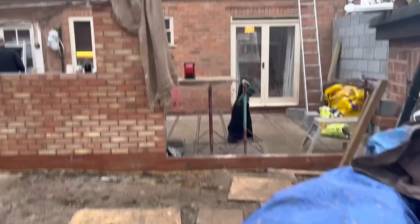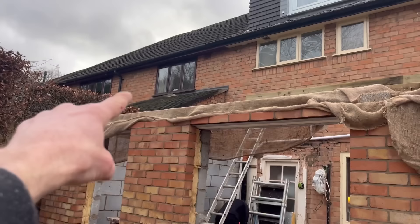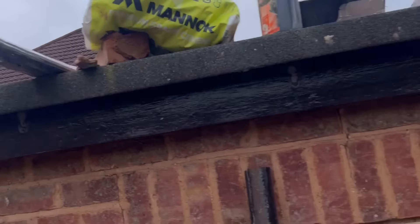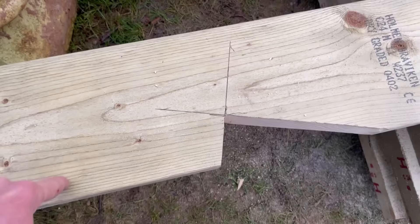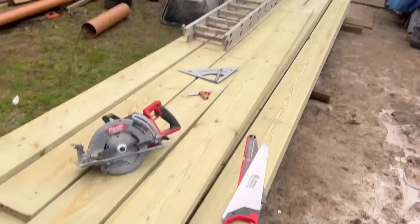Because of the size of the lintel and not much brickwork above it, we're going to have to cut a notch over that lintel, which is a bit of a pain. This is a three-metre span — actually a three-point-six lintel — so it sits up higher. We've probably got about 50mm and will need to take about 15mm off. Rather than do it beforehand and make it look rubbish, I'll put it up, make a mark, then work that out. We'll try the pattern in three separate places to make sure it fits.